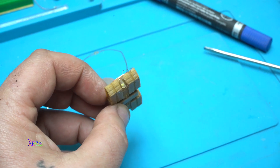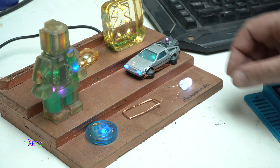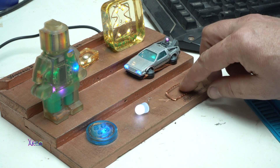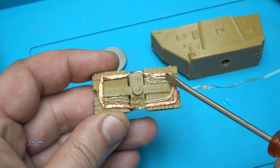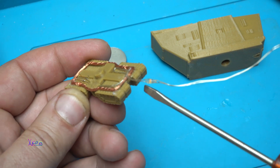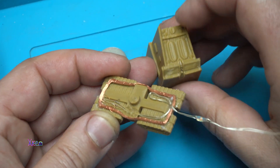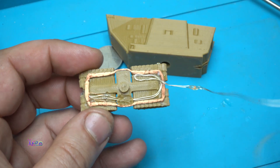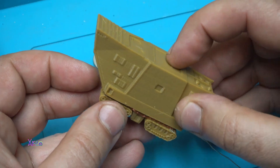I have a couple of videos you can check in links below on how to make the receiver coil. But in this case, for this toy I made a small receiver coil out of 30 loops of solid copper wire. That coil is fixed on the bottom part of the toy, and directly on the ends of the wires you just solder the LEDs — and that's it.